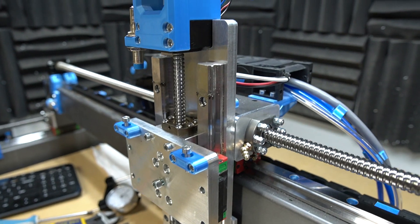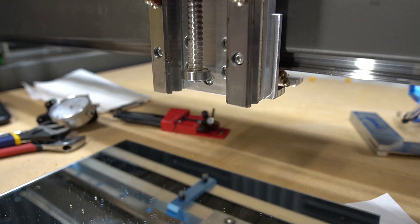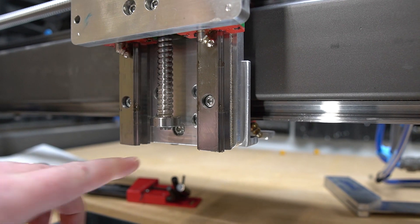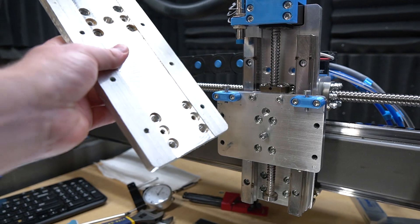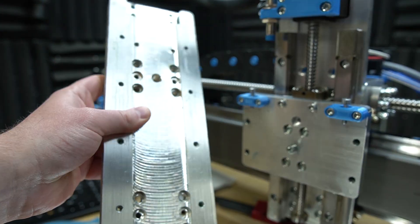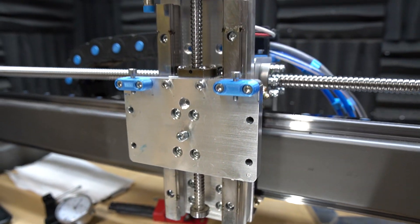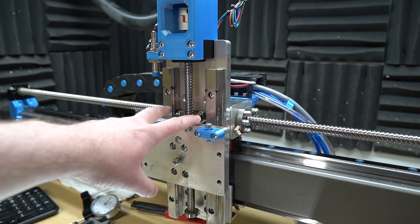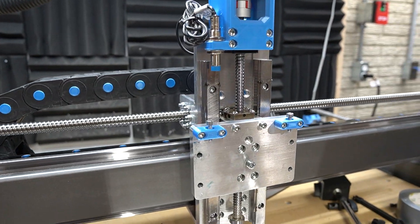The surface quality is pretty awesome. The biggest difference between the version 3 and version 2 plates is the tramming. You can see the M6 right here — this is your only tramming bolt on the bottom. Previously on the version 2.1 plates, you had two set screws for tramming. It works, but it's just another bolt to worry about. That is one nice thing about the version 3 upgrade, and this is the default layout included in the design.